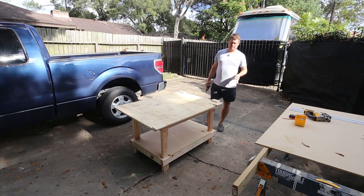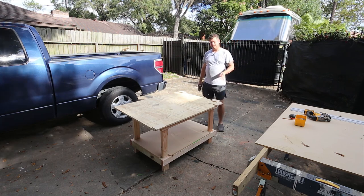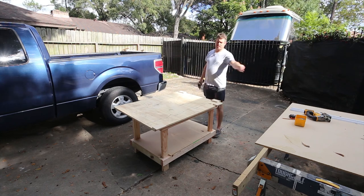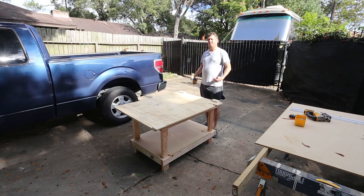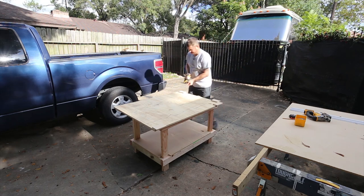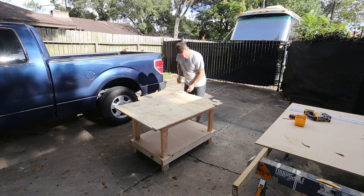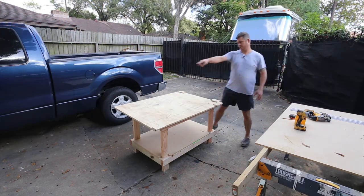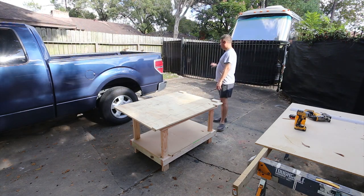I have a 3-foot by 4-foot piece of three-quarter-inch plywood which is what I want to use for the top. I've taken the scraps cut out from the bottom and I'm going to use them as stop blocks — positioned 2 inches from the edge on each side so that when I attach the top it lands exactly where I want it. I'll use screws to tack these in place but not drive them completely through. Next I'm going to put some polyurethane on the frame, flip it over, set something heavy on it, and set it out of the way.